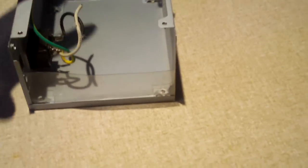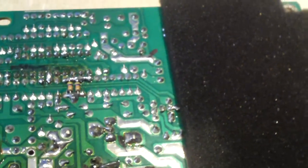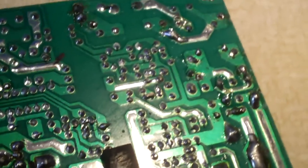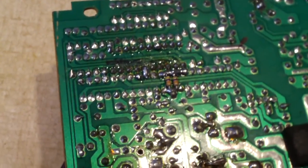This angers me, but not as much as what's on the bottom side of this PCB, which I'm about to show you right now. It's like they attempted to make a quality power supply but failed. The casing has plastic on the bottom — that's a good thing, good for insulation. And they actually padded the primary side with foam. I mean, they attempted to make something decent here. Now let's have a look at the soldering quality — on the primary side it's pretty decent, but look at the secondary side. This is where they just up and failed.